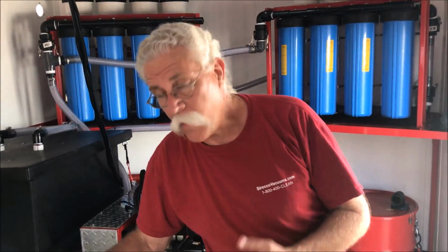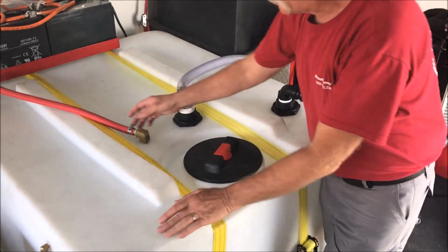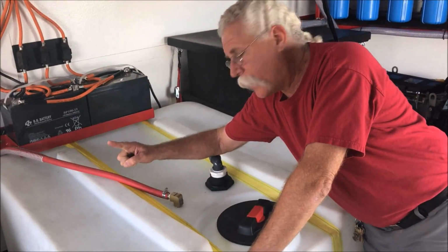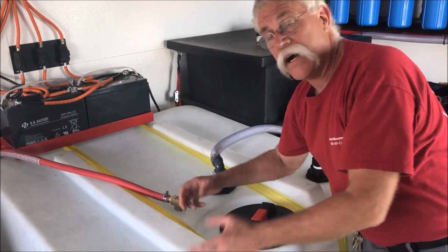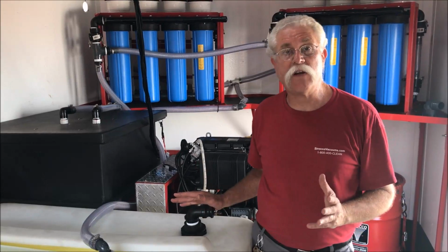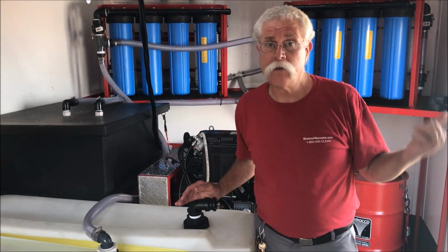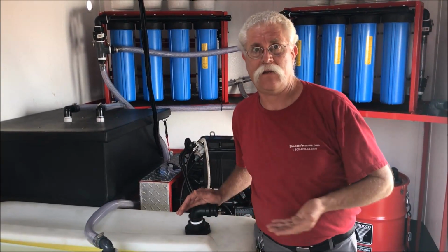While we're standing here, I mentioned water supply to this crazy big pump system here. Well, we've got a nice big beefy feed line coming in from that water supply. There's a float valve, a big float valve inside here, a Hudson type float valve. We've also supplied this particular configuration with a fast fill. What I mean by fast fill, I mean hooking up to a doggone fire hydrant and getting water in this tank in a minute, okay?